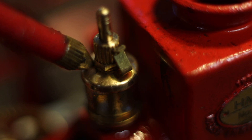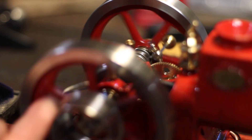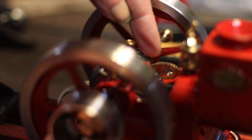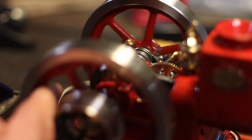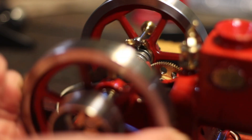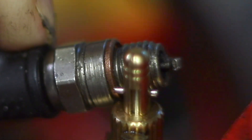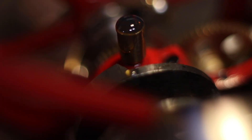Then I discovered another problem. The model comes with very accurately punched timing marks, and you have to align one little punch dot between two cogs with two little punch dots — that supposedly is the ideal timing for the spark. But they're wrong — way wrong. When we built it to the engine spec and I pulled it over to check the spark, the timing set on the model fires somewhere during the compression stroke. It really needs to fire just before top dead centre. So you need to take that apart — which is fiddly — and adjust the timing so it fires the spark plug just before top dead centre, and then you're in with a chance of running. Good luck with the carburettor — fiddle with the settings and eventually you will get it running.